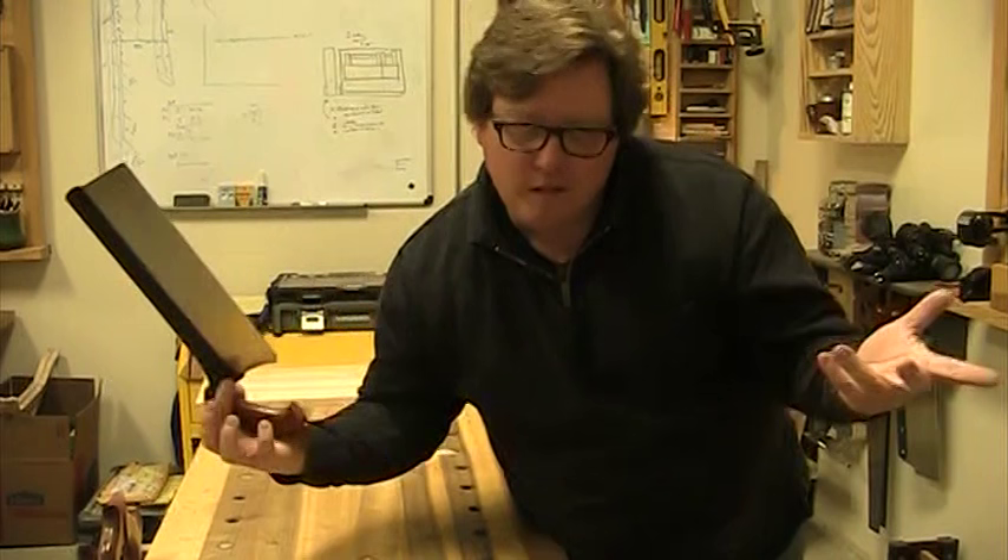On the two side boards, mark the knife all the way around using a technique called relative marking — to compensate for any error. Even over a long distance, if the square is an eighth of a degree off, using this relative technique means that error will be balanced on both sides and negligible for woodworking. This nick mark is your reference edge, and you mark both directions from it. If you were to mark it one way, then the other, you'd quadruple the error instead of complementing it.